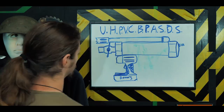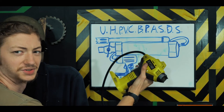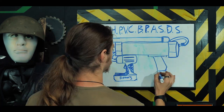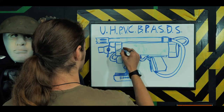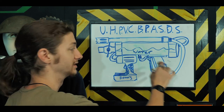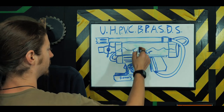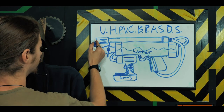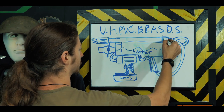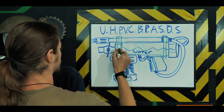We're going to use a battery-powered pump right in here. It looks just like a drill — goes to about 100, 150 psi. It's just a pump and it works well, and it's battery-powered so you don't have to pump it by hand. The pump is going to feed air into the water chamber, creating pressure inside there. Then the water will feed down here and stop at this valve. When I pull the valve, the water goes down the tube and out the barrel — splish splash, whatever. We're going to hold the different parts together with pipe clamps, which are just going to strap the whole thing down like so.